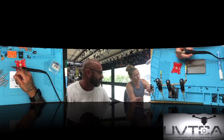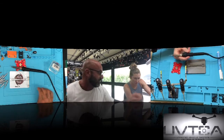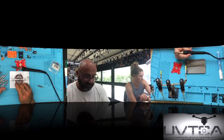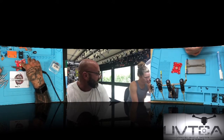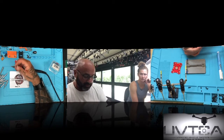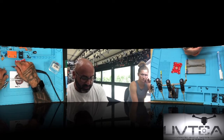Why don't we use this one? Because that's going to be for finer soldering, like when I take a processor off the board. Something like that with very, very fine details. What you're going to be soldering today is pretty much pads this size, so you want to go with something that's easier, because these, while they're really awesome, don't move the heat as much. This is pretty much what we're using, a rounded tip like this one, and they're more common.